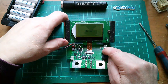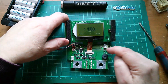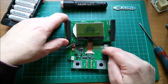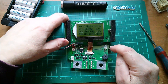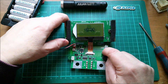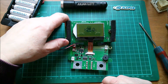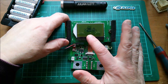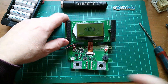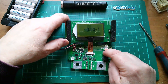The backlight is actually on on this board because it's powered with 7.2 volts. I can flick through the screens — there's one where the backlight is on, and if you hold the button it scans all the way down from on, through 59 seconds, down to off. Double-click goes up to one second, then hold it to increment. I'll keep holding until it gets to backlight-on. There's a screen showing greater than 160 volts alarm and less than zero volts — that's probably what was making the alarm sound.